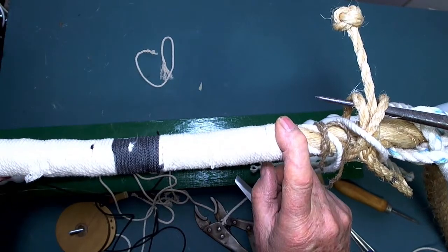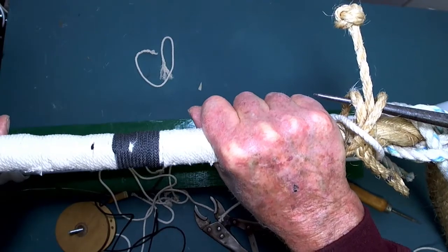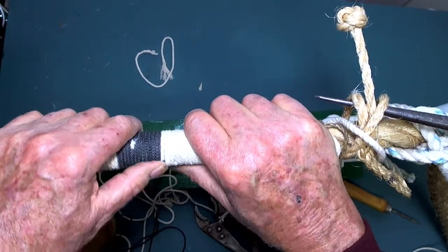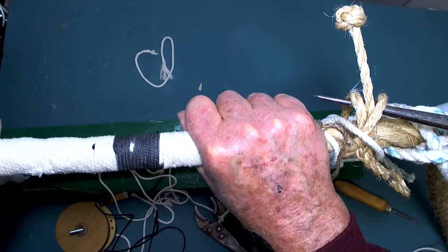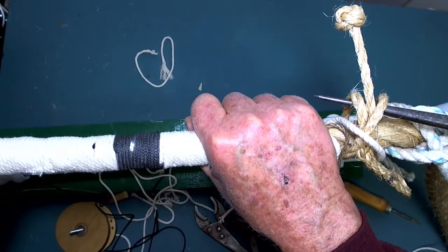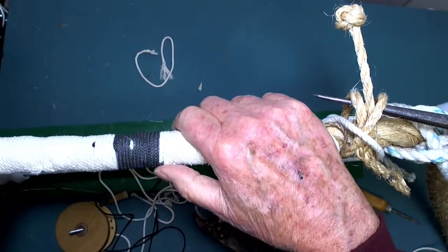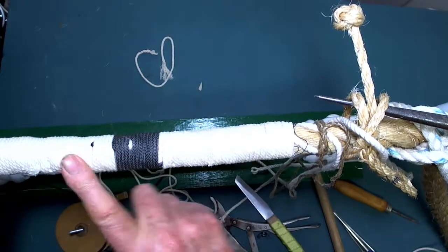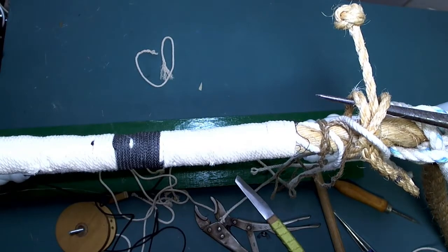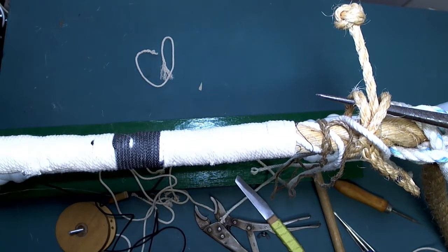This is one that could be quite often applied on the Craig. Some crew have spent a busy time redoing stays. One comes to mind, the main topmast stay, where they had to do this being lowered down along the stay in a bosun's chair. Took them a while, but that's the way they did it. Because once that's finished, you cover it with your rigging black, etc., to seal it up to keep the moisture out.